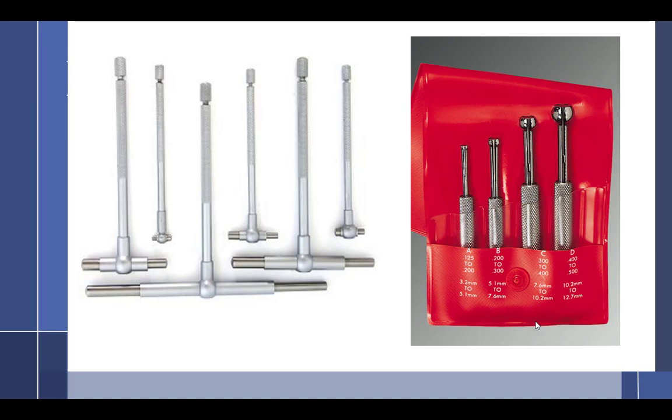I have to measure that because it's going to wear differently. If I measure it and it's angled up like that, it's called choke. And if it goes like that, it's called taper. If you forget that, come up to me and I'll explain it to you. I will grab your neck and squeeze and say, when it gets tighter up at the top, it's called choke. So I won't do that. It says I can in the waiver, I think. But I'm not having you worry about that. I just want you to get the feel for this.